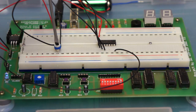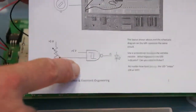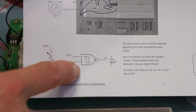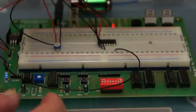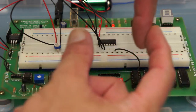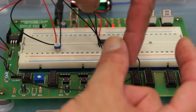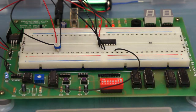This effect is called hysteresis — you probably know it as backlash. That's the main thing about this special gate, which has a special symbol with a funny little shape in the middle, actually a hysteresis loop — you sometimes see it in magnetic theory. This is a digital backlash circuit. Just like mechanical backlash, if you want to change direction you have to take up the backlash first. That's exactly what this Schmitt trigger gate does — if you want to change how it sees an input, you've got to really change it; you can't just slightly change it.